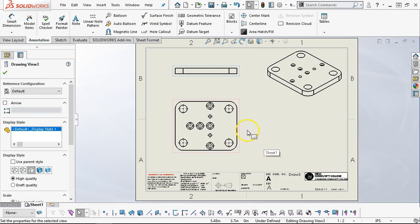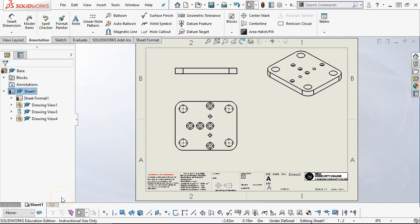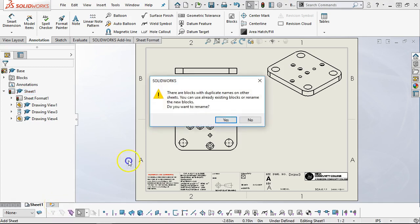Right, so the counterbore holes, those have pretty well open tolerances up to the plate and to the gusset. What is going to be a concern, and we're going to have to look at positional, are the two pins. We want those pins to line up and provide a certain amount of perpendicularity, or positional, so that the perpendicularity stays perpendicular. All right, so add the sheet.